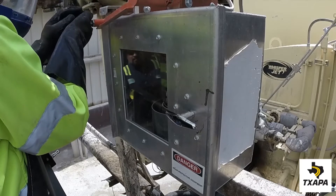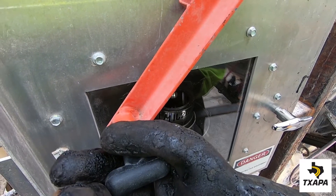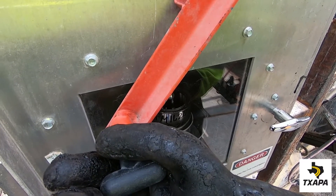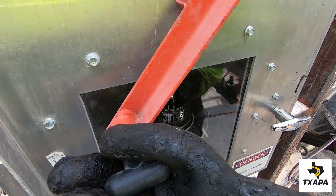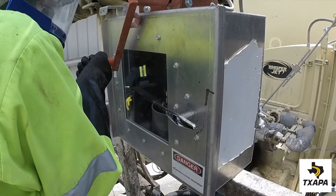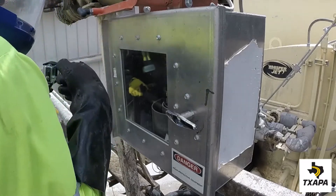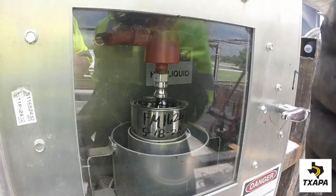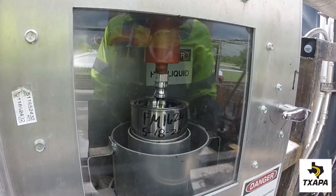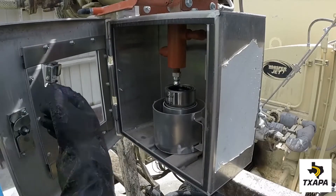Notice that it covers the door while it's filling the can. As the bar is lowered, the material flows from the inline heated line into the sample can. Once the can is full, close the lever and relatch to complete. Allow the material to drain into the can, then remove the can and cover and seal tightly.